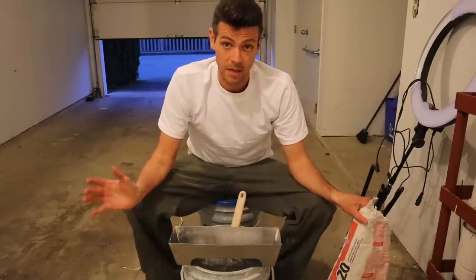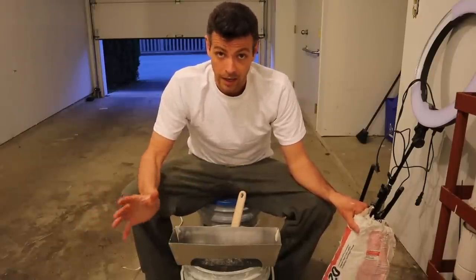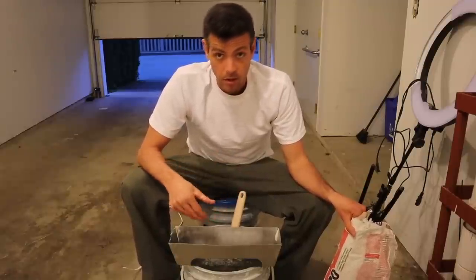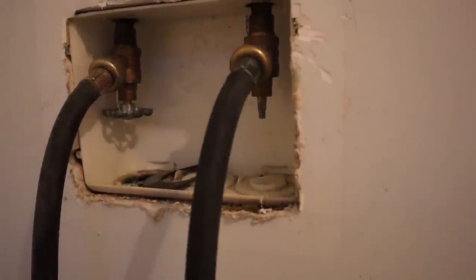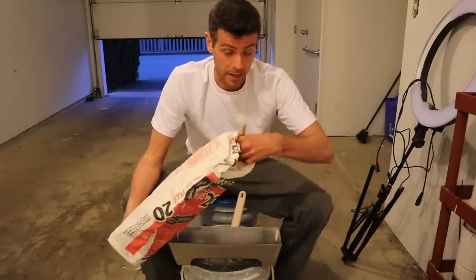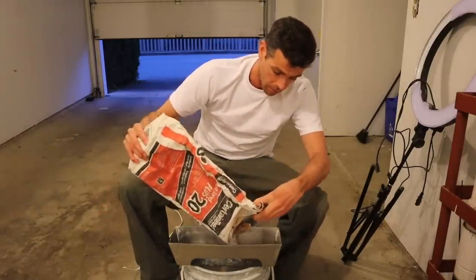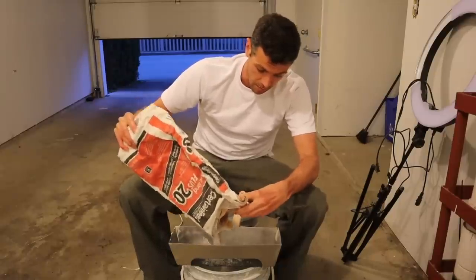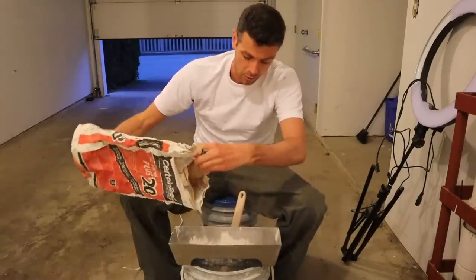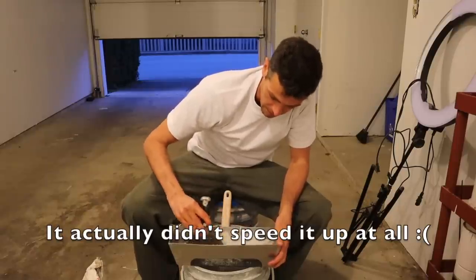Okay, you guys, this is gonna be interesting because this water I have here is piping hot and I gotta mix up some 20 minute because the hookups for the washer, only the hot one was connected. So now I gotta use hot water to mix up my 20 minute and that's gonna accelerate it a lot, which is actually good because now I won't have to be waiting, but hopefully it's not so quick I can't even get it out of the pan. And I wanna mix this stuff up really thick. I don't want it slumping. All right, let's get this mixed up.